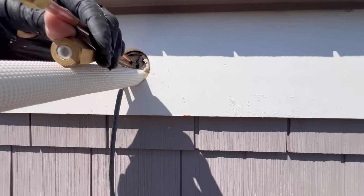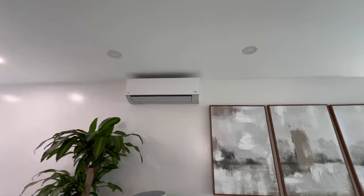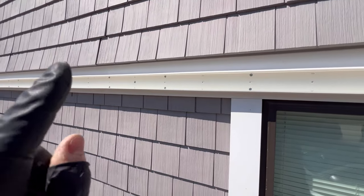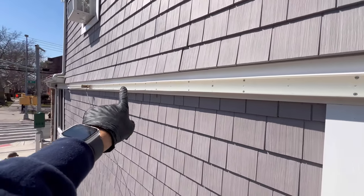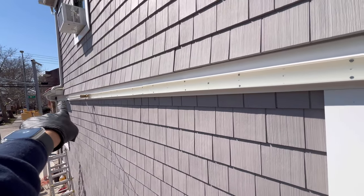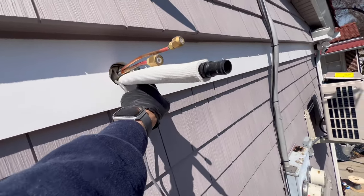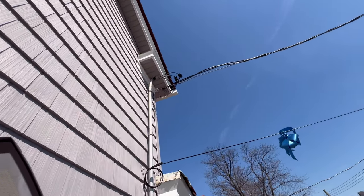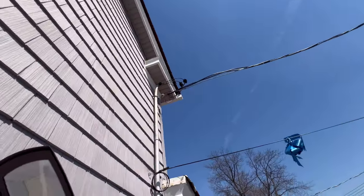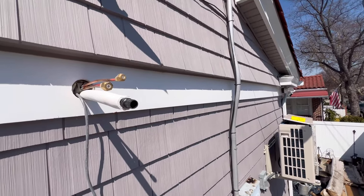The electric is really high up in the right-hand corner, but it's going to look good. We're going to swing this drain that way, swing this line set this way. We went with four-inch white line set covers — we got three lengths up. We're going to shoot the condensate that way, and for this one we're going to shoot the condensate towards that leader. Right now we're cutting a piece flush to here and then another full length to get around that inch-and-a-half galvanized pipe that goes all the way to the pole with those two live lugs.